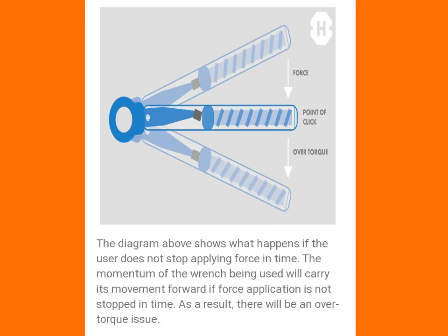Here's another drawing from the manufacturer's handbook. The torque wrench is shown in the middle and it has snapped. Once it snaps, you've got a breaker bar with an unlimited amount of effort that can be put on it — you've now gone past your torque. The only way you will make this torque wrench read over is operator error — carrying on after the click. Obviously, the further out you are with your hand, the easier it is and the less chance you'll make an error. The nearer the fulcrum, the more chance you'll make an error.